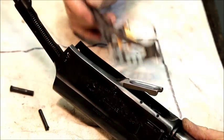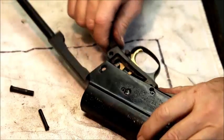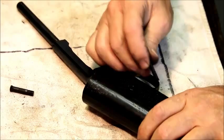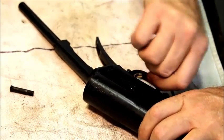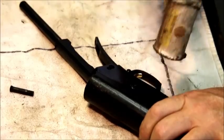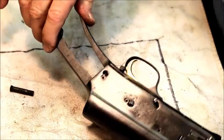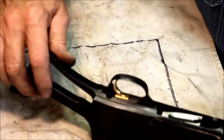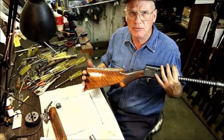Hammer retaining pins in place. Now we're going to put our trigger plate in the receiver. You always put the trigger plate in at the front first — put the front in like so, then take the smaller trigger plate pin, which goes in the front, and put it in position. Get your trigger plate in there, line up the holes and put it in. At this point, you cannot just push the trigger plate up into position because it's hitting on the carrier spring. So you have to bring your bolt back just about a quarter inch or so. This stock was refinished down in our wood section — just a beautiful set of wood. This is all factory; I didn't replace it. This just happens to be a Browning Sweet 16 with some real killer fiddleback in the wood.